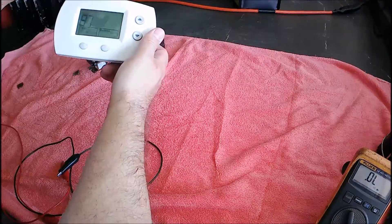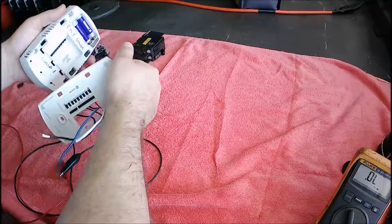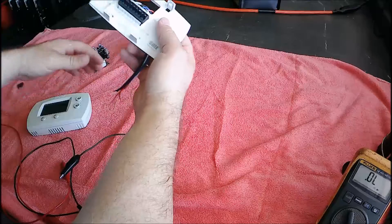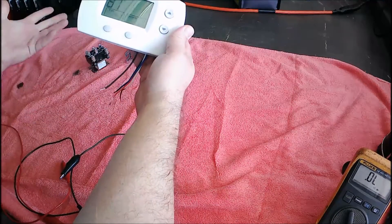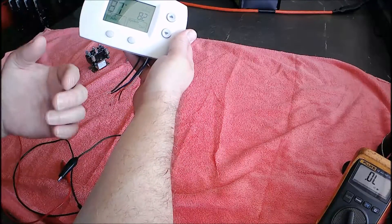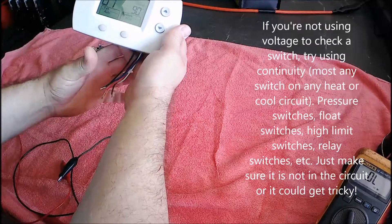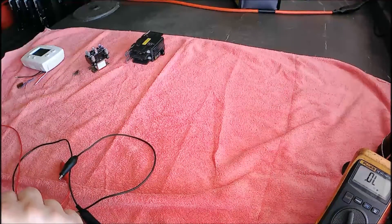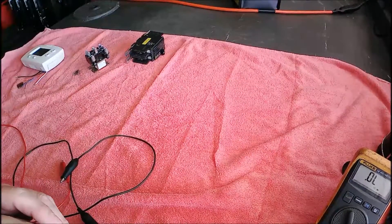The last thing: you can use continuity on a thermostat if you doubt it's working properly — a lot of them out there are misdiagnosed. Take it off the wall, throw a couple of double-A batteries in the back, and using its sub base take some thermostat wire and wire it up. The batteries will power it. Turn the fan on and check continuity between R and G — see if it beeps, then turn the fan off and make sure it doesn't. Put it in cool mode: you should have continuity between R and Y; R and O if it's a heat pump; and so on through heat and emergency heat. Continuity is something a lot of people overlook. That's it — it's hot and sweaty, the attic is blazing, stay hydrated out there.